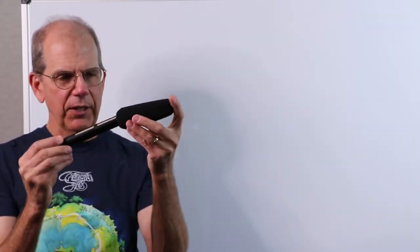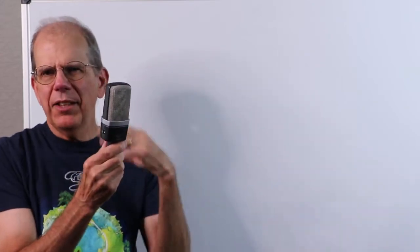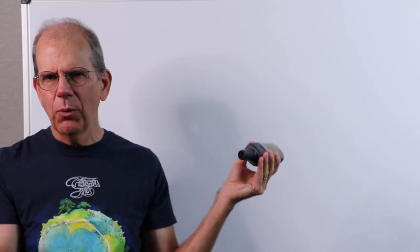How do they work? For example, you might see a little pencil like this — this is a little AKG condenser microphone. This is another kind of condenser microphone — this is a mini shotgun, which I'll talk about in a sec. It has a little windscreen. If you're outside, wind hits the diaphragm and can make all kinds of nasty noises, so we put a little windscreen on there. Here's another AKG condenser — this is a 214, what's called a side address microphone.